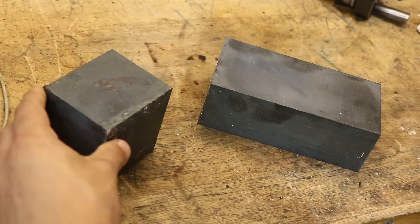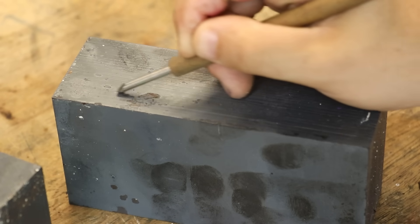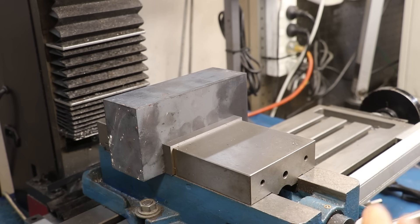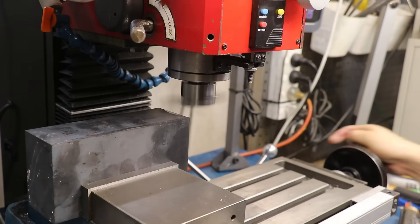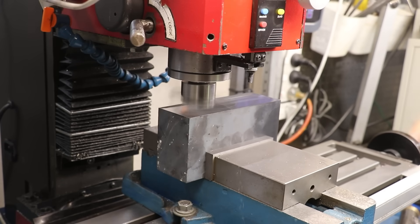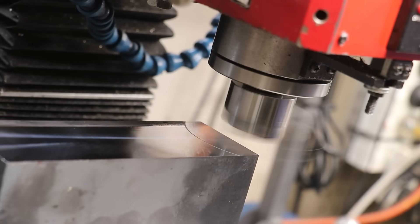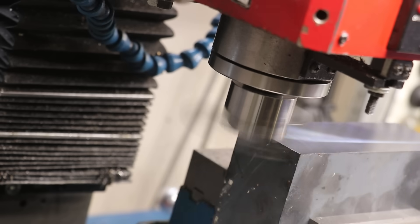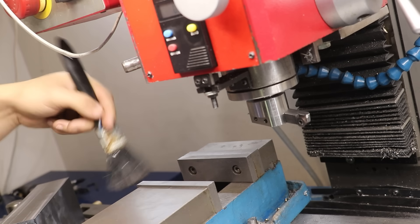The next day the parts were cooled and good to go. They picked up a little bit of scale but that's nothing to worry about. The first thing I'll do is get them in the mill and cleaned up. Someone had asked why the fly cutter was cutting on both sides — it was a little bit out of tram, and ever since re-tramming it it still cuts a little on both sides. My best guess is the tool holder is deflecting slightly on the first pass; I think the new inserts aren't as sharp and it's simply flexing on the first pass and then cutting on the back.